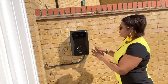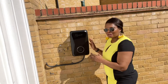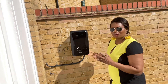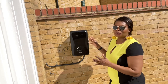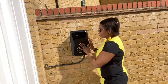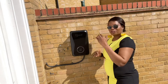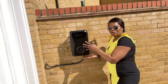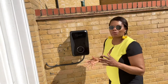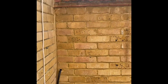For this installation you need a metal fuse box. If your home currently has a plastic one, you might need to change your entire fuse box for about £600. I didn't want to do that, so I just got a little spare consumer unit specifically for this charger, which cost about £50 to buy. If you go through a professional installer, they'll include fitting the consumer unit for an additional £150.